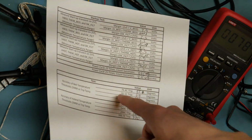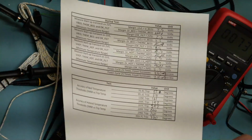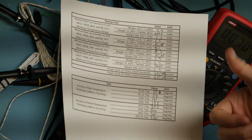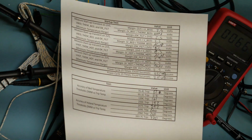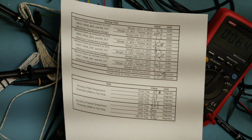Just so you know, there are 3 known defects in this design. The hole spacing of our spade terminals is incorrect. A 0-ohm jumper needs to replace the transistor currently controlling the auxiliary 12-volt output, and I decided that a JST-XH connector would be much more suitable for the auxiliary power output than the spade terminals currently being used. I haven't had the time to make these changes yet, but it's on my list, and I promise I will update the design files on Patreon with a second revision once these corrections have been made. What I did for now is just cut off one leg of the TE spade terminals to get the thing installed, which is pretty hilarious.